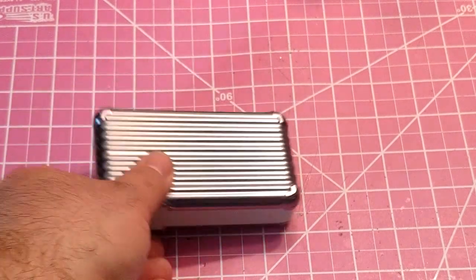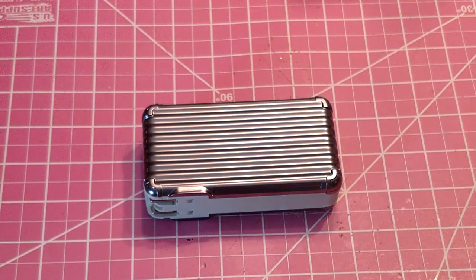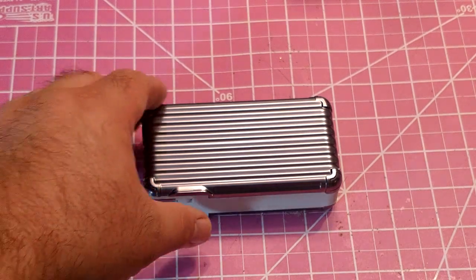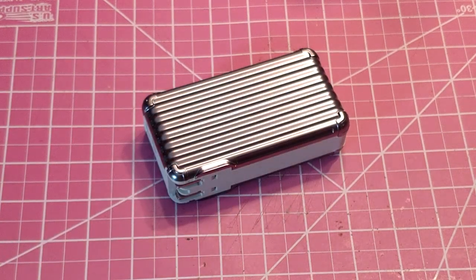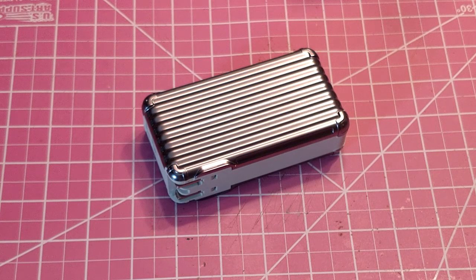Alright, testing — that's what you're really here for. How did this thing pan out? Not bad at all. You're going to see some images cut in here of my test results using an electronic dummy load and a USB capacity tester. I was able to determine that this has about 6,850 milliamp hours available. Now I know you're saying — what about 10,000? I've gone over this in a couple videos already, but the quick explanation: the batteries in these are 3.7 volts and USB is 5 volts, so there is a conversion and efficiency is lost in that process.